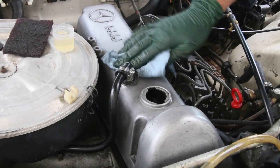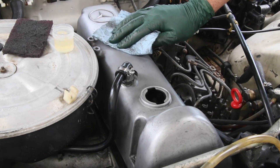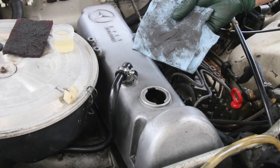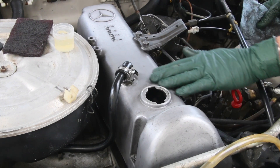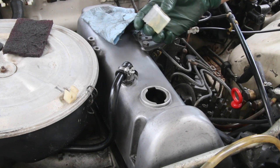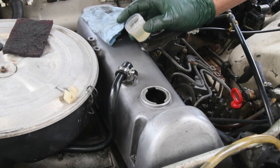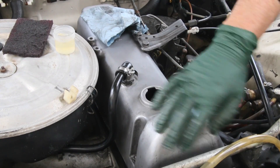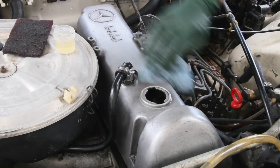When you've polished it about as much as you want — you can go to great extremes, even pull this off the engine and make it look show quality — but that's not the case for this 240D. Just wipe it down. You're going to pick up a lot of extra fine metal particles in the anti-corrosive gel, but don't worry about it — you're going to leave this film on here. You can see that on this valve cover I've only used about a third of the gel in this bottle. It is a pretty expensive chemical, but you don't need very much — this is probably good for two engines. I'd recommend about once a year, come back and put a real light film on your aluminum and magnesium parts.